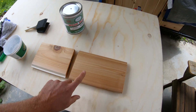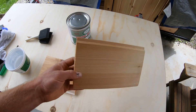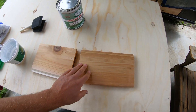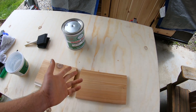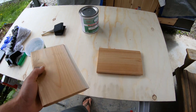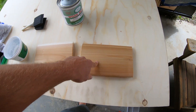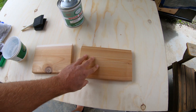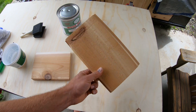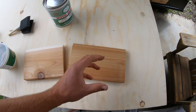So, here's a caution. When you go to treat wood with anything, keep in mind that wood is porous like a sponge. Anything that you put on it, whether that be a stain, a varnish, or a sealer on the wood, it's actually going to penetrate down to the core. Which means that if you don't like the varnish that you use, you're not going to be able to sand it off, because it's going to be permeated through the wood.